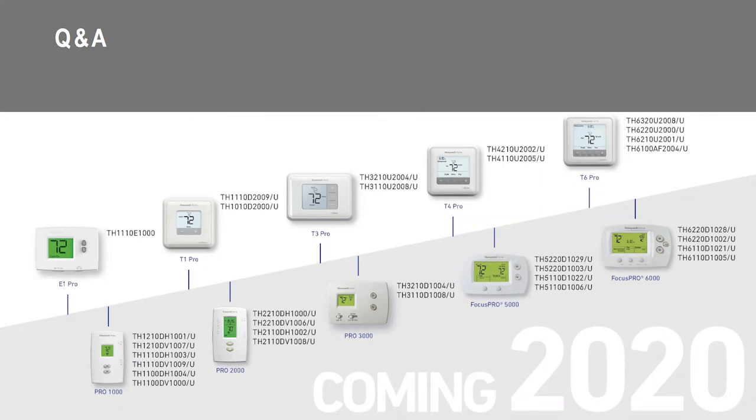A question: can in-floor heat be controlled by non-connected thermostats other than the T6 Hydronic? For air sensing only — yes, any non-connected thermostat can be used. For slab sensing or combination slab limits with air sensing, that capability lives inside the T6 Hydronic. The T Series non-connected thermostats lend themselves better to floor heat applications because you can set them to heat only, avoiding confusion from seeing cooling switches on the thermostat.